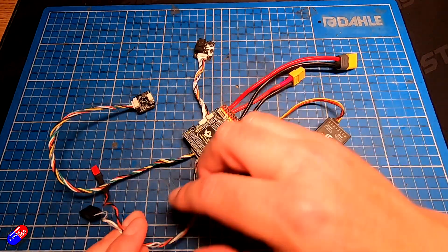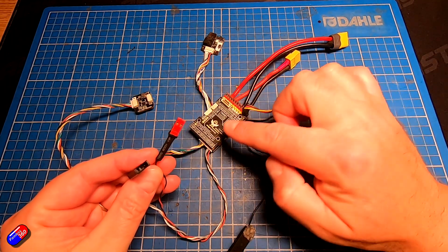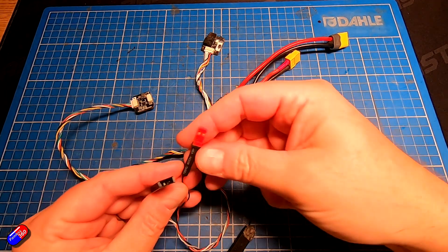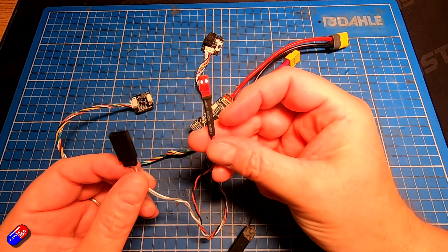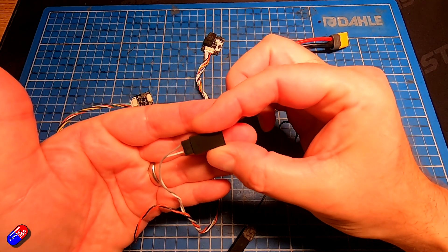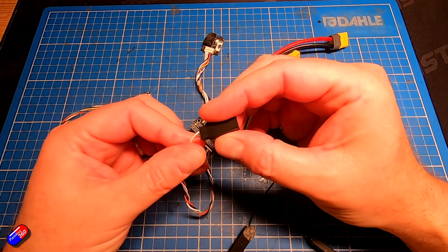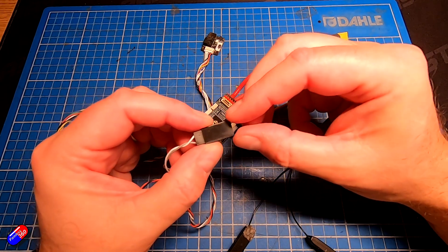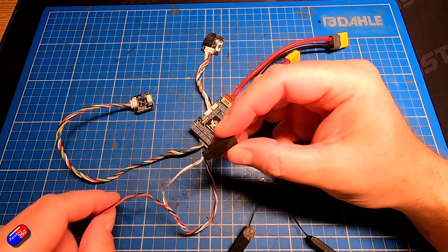The only last cable on here is this one — this is for the FPV kit. It's set up so that there's an SBUS input on here as well, but I've terminated it into a JST lead. That's going to be the power connector for the Walksnail unit that I'm probably going to add later on. Then I terminate the transmit and receive pair into a little Dupont style servo connector, and on the other end of the Walksnail unit there's the same thing. If I get it the wrong way round — transmit isn't connected to receive — I can just switch the plug over and fix that.